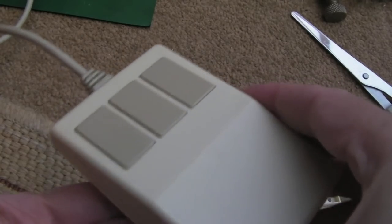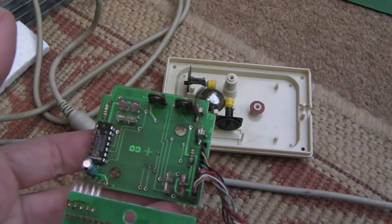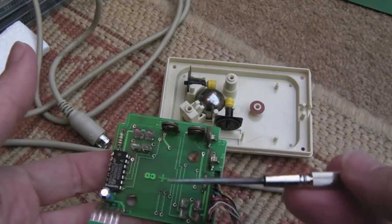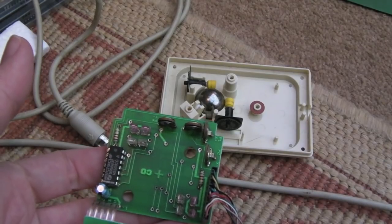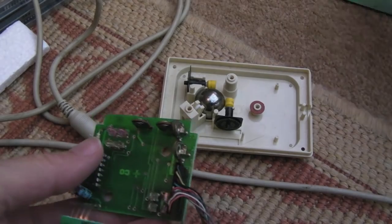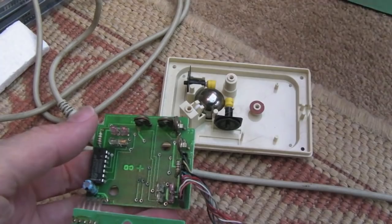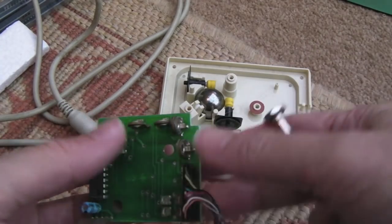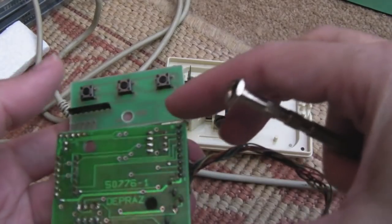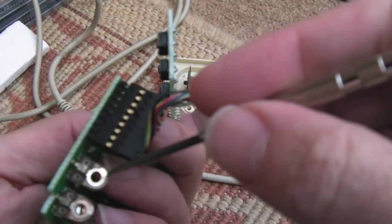So I feel like I'm fighting a losing battle with these. I reassembled it and thought it should work, and it worked alright in left-right but wouldn't work up and down again. So I thought oh there must be something wrong here. I took it to pieces and found the potentiometer on the inside had failed - it's got nothing, it's just broken. I've looked - it's rusted on one side, it's sheared off. So there's been no pressure on that. It corresponds to the up-down movement axis. So I need to replace that pot.